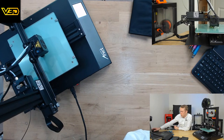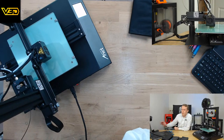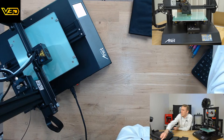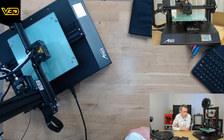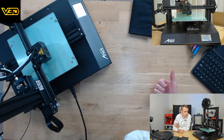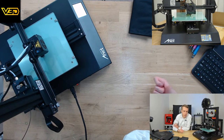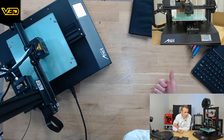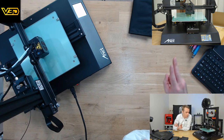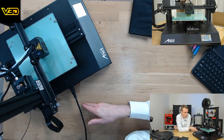The connections, we looked at the Anet at the beginning of the stream in terms of build quality, electrical stuff. All actually quite good, I thought. There's locking connectors on all of the connectors on the motherboard, which is nice. So unlike Creality, who uses glue, they've just gone for the proper solution, which is locking connectors. Both the mains and neutral wires were cut on the main switch. So it means when you cut it off, there's nothing going to the power supply. It just stops.